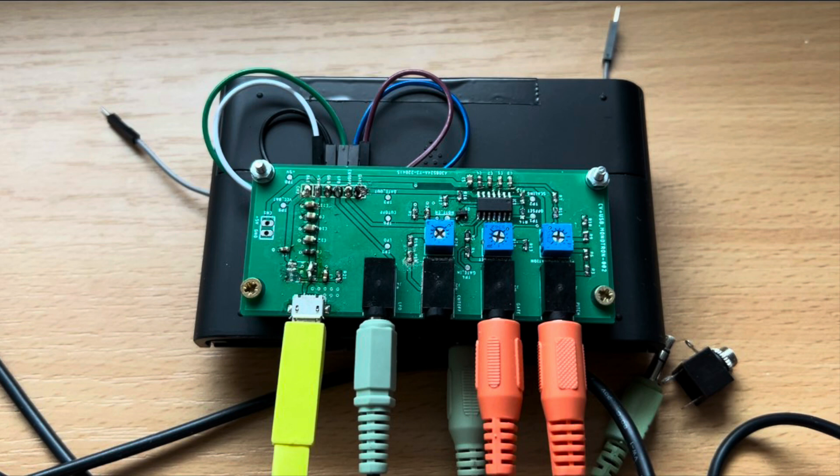Now I'm going to go over the working of the interface board, so if you are not interested in that, skip to the demo part of this video. The standard Eurorack control voltage for pitch starts at 0V for the lowest note and increases by 1V per octave. However, the internal Monotron VCO works on 0.44V per octave instead.